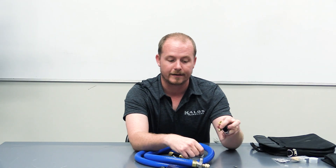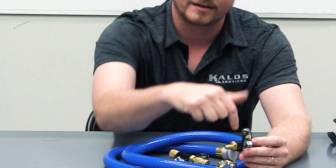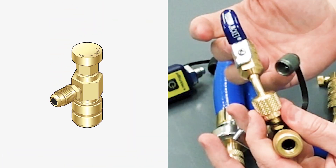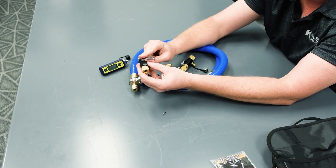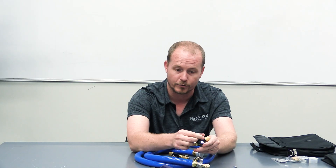Keep in mind: do you have a core in place and is it being depressed or not? Make sure you're connecting your vacuum or recovery hoses to the end of the tool, not to the side. Consider using a core depressor or ball valve to help protect your micron gauge. And as always, don't remove anything other than the end hose with the valve shut before you get the system under positive pressure — if you try to pull your micron gauge off the side or put your core back in under vacuum, you completely lose your vacuum and waste all of that effort.